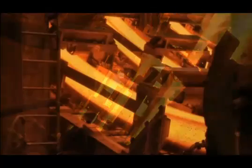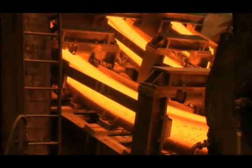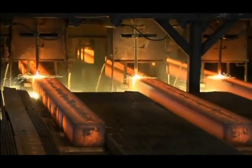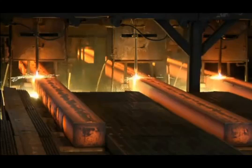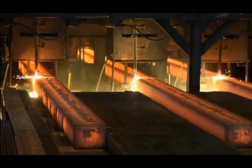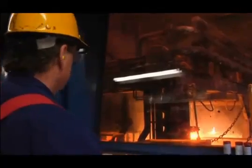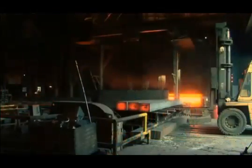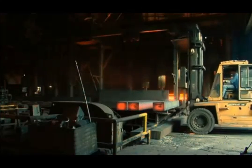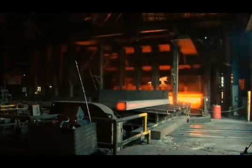As the steel begins to solidify, it is pulled down the molds and out to the runout table. The strands are straightened and cut into blooms of specialty carbon or alloy steel grades. We sequentially cast multiple heats of steel, making this a highly efficient, high-yield production process. The large bloom cross-section ensures a good reduction ratio with enhanced overall properties in the final steel products.